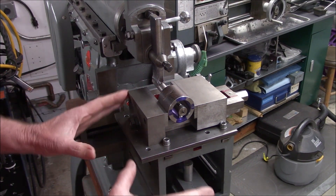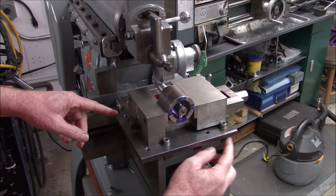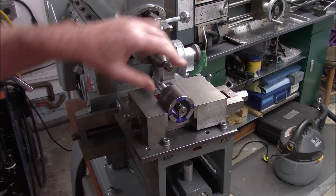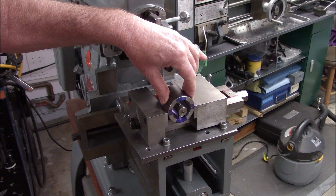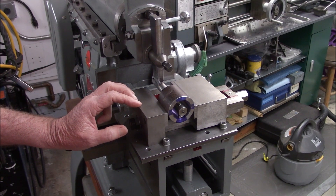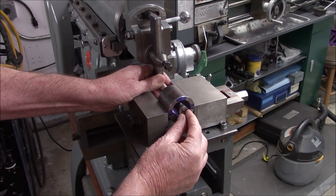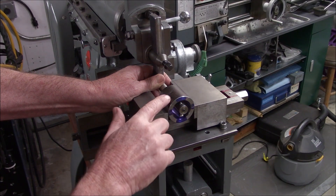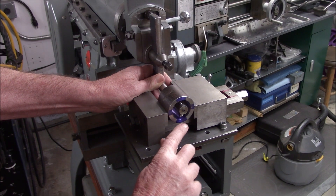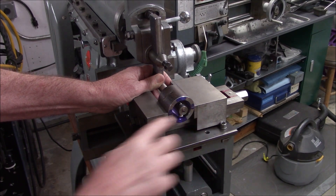What I had to do is move the vise as far forward as we can - we're right on the very end of our T-slots - and then our sample workpiece is all the way to the front of the vise jaw, which is not ideal. It should be in the center, but hopefully we can get this test done. To square up our tool bit I laid a parallel across and made sure that our cutting edge was flat and parallel to our vise.